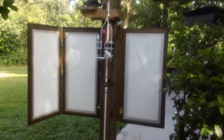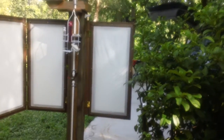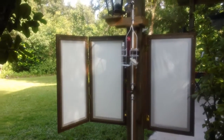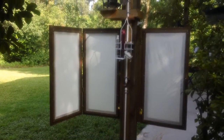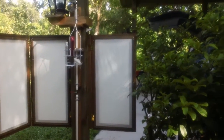We put in three screens: a left double panel and a right single panel. I'm going to do a little repair work on that — the splines need to be a little bit thicker to hold the fabric tighter. Essentially it's three two-foot by four-foot panels. The interior is a shower curtain cut to fit, and we routed a dado inside the outer perimeter of each two-by-four-foot panel and installed rubber splines like you would with any screen enclosure. It made it drum-tight on the left side, and it will be drum-tight on the right side too, taking out that little wrinkle — but it functions perfectly.